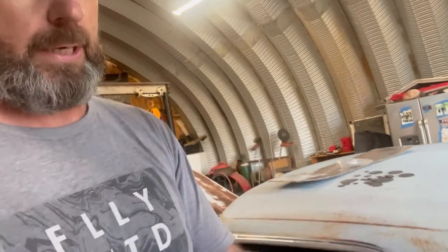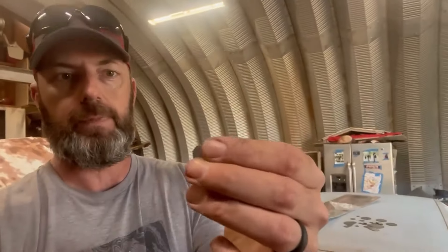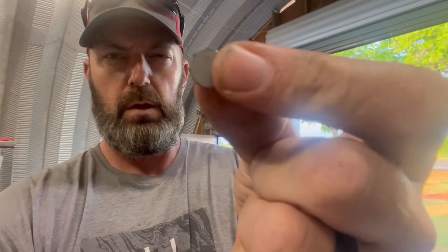I think it was this one here — maybe that little tiny one. Yeah, that one there is it. I don't know how well you can see it, but let's get away from that light. It's got little tabs on it from where it was cut. I just had to grind them off a little bit with a file and then put it in there with the magnet and weld it in. I'll show you real quick how I did that.